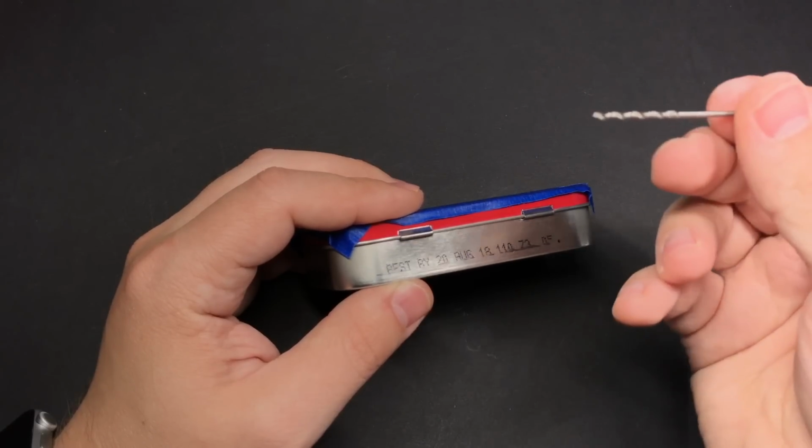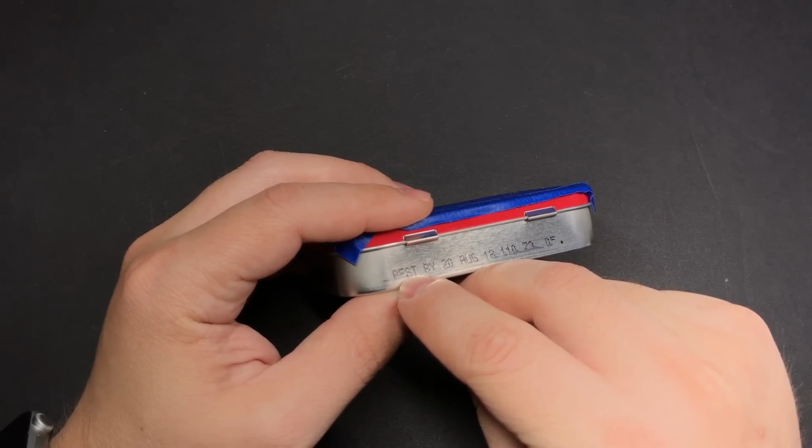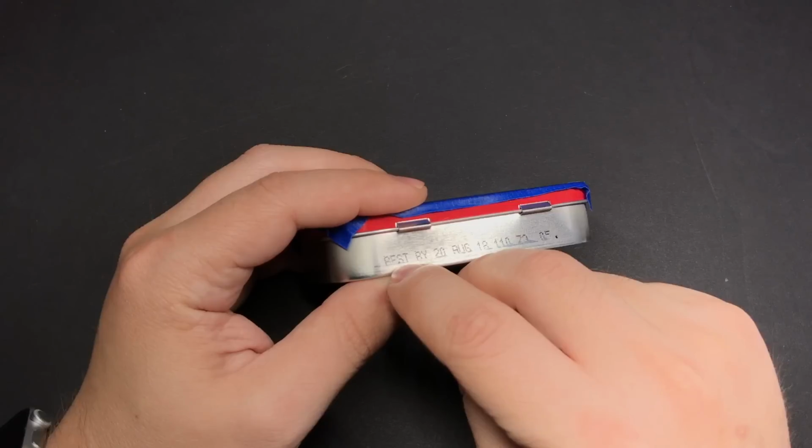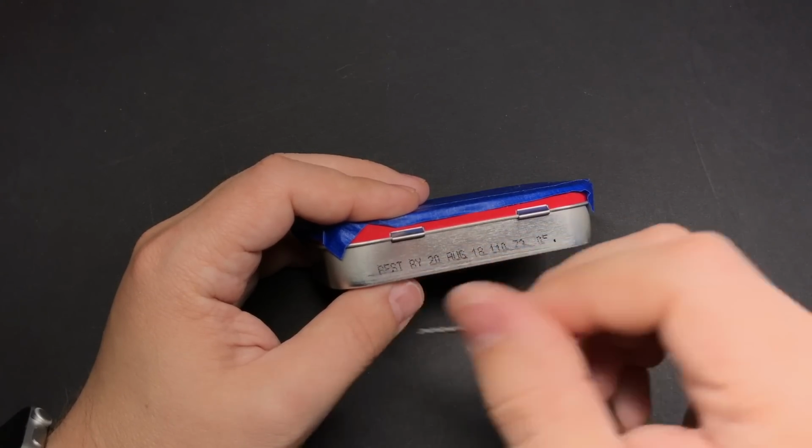And before you even drill your pilot hole, take something like a nail and just gently push in on the exact spot that you need your pilot hole, so you create a small indentation or even a tiny hole so that it holds your drill bit in place.